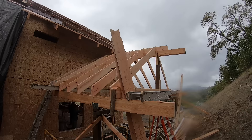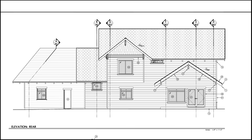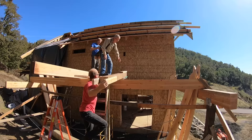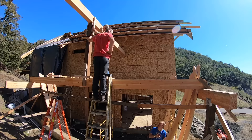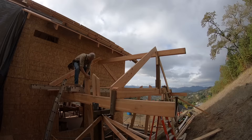Today we're going to cut and stack the common rafters that create the roof for the back porch of our spec house. Stack means install, and a common rafter is a rafter that spans the entire distance from the exterior wall to the ridge, which is usually at the center of the span. Almost all of the wooden I-beams you've seen us install as rafters are technically common rafters, but the rafters we're making today are cut from real lumber and have a seat cut — part of a bird's mouth — at the bottom.